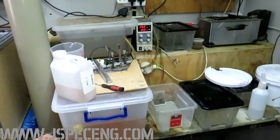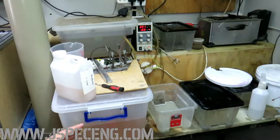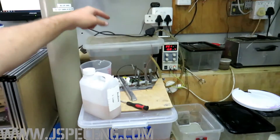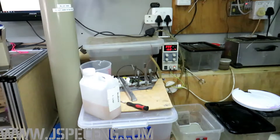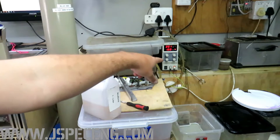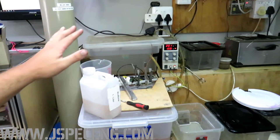I've got a 30-litre tank at the bottom, usually filled to about halfway. For chilling, I use frozen 2-litre and 1-litre bottles — Coca-Cola or Pepsi — filled with water and frozen. I'll drop three of them in to pre-chill and bring my temperature down to below around 18°C. This gets pumped up into a water jacket around my acid tank. I have a 4-litre acid tank inside a bigger container with a water jacket around it, which contains bicarbonate soda so that if there's an acid spill it self-neutralizes. I'm using a 5-amp hobby power supply, and there's an extraction tube pulling fumes out at all times.